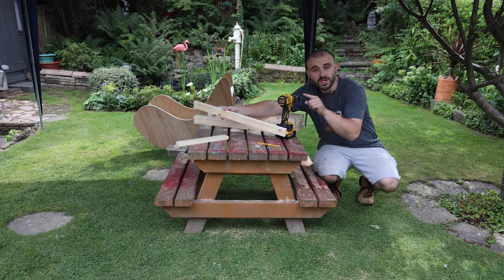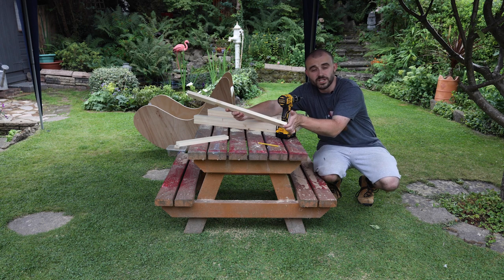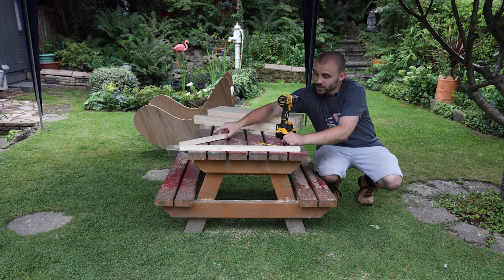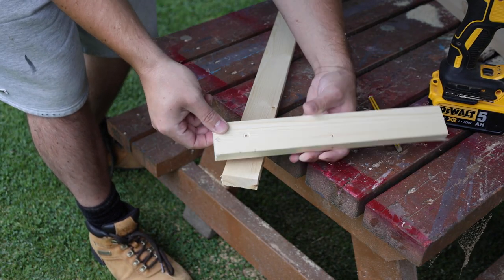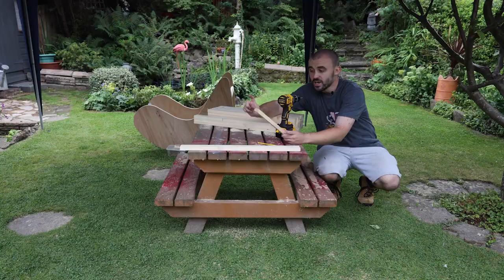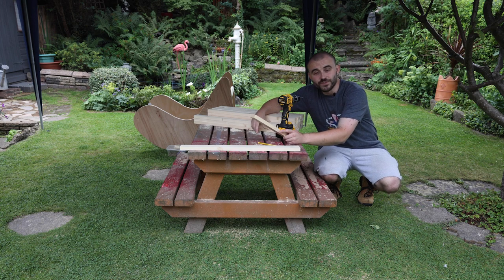What I've got here are 24 pieces cut to 60 centimetres long - the same wood I used for the three pieces on the back. This will give me a bit of an overhang either side which will look really nice and give you somewhere to hold your fingers, which is always helpful. I need to drill pilot holes, one in each side. To help me along I've made a bit of a template from an offcut with a hole marked so I can offer it up to the edge of each board and know it'll be in exactly the right spot. That's 48 holes to drill in total.